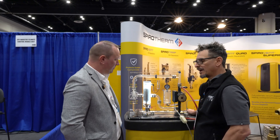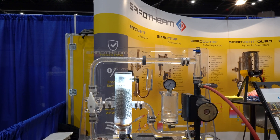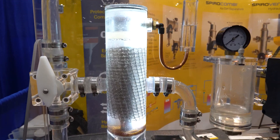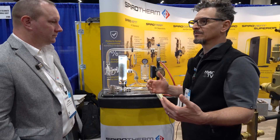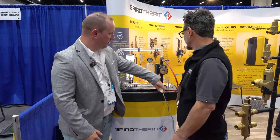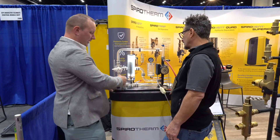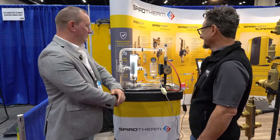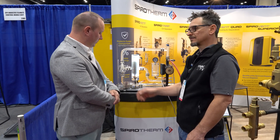It's incredible. It's so simple. Heather, do you want to try and zoom in on that? It's amazing how fast it's removing the oxygen from the system. And again, the whole point is to prevent oxidation from happening, which makes it all rusty and deteriorates efficiency. That bubble got absorbed into the system — I'll put a little bit more air in to demonstrate again. But I think people get the idea. And this is called coalescing? Correct. It's this copper media right here — it's a little pointy. Can you guys zoom in on that?